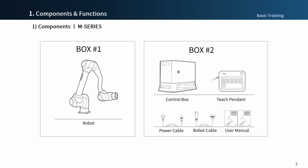The Doosan robot is a 6-axis vertical multi-joint robot similar to human arms. It is different from horizontal multi-joint robots that move in a horizontal plane, called orthogonal robots or SCARA robots, where each joint moves in parallel. Generally, the collaborative robot uses 1, 2, 3 axes for position movement and 4, 5, 6 axes for angle movement, and has a spherical working space for any angle representation at any location.